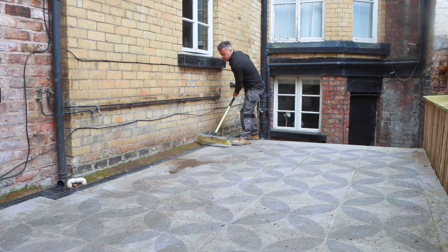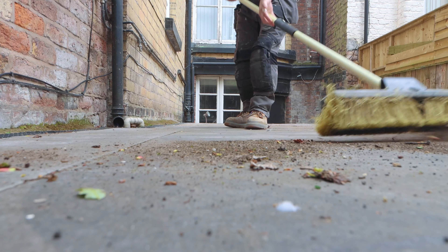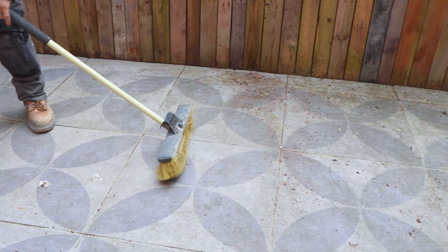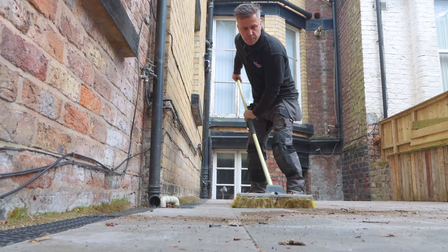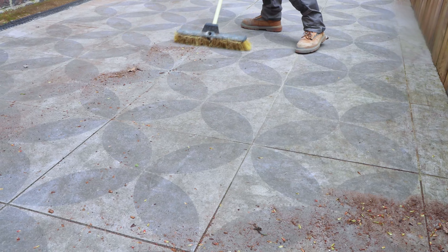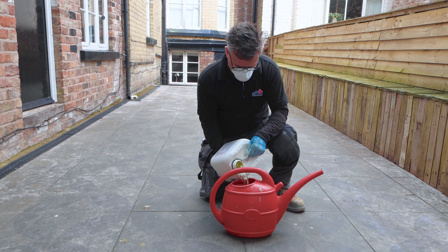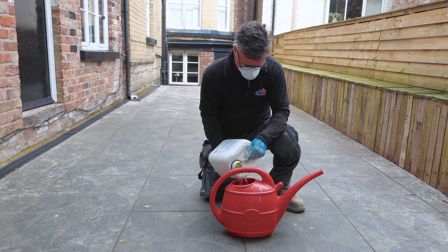So of course a lot of sap and things are falling from them making that end a lot stickier and grimier. Start by clearing off all dust and loose debris from the surface and clear away any furniture so you've got a clean run at the area. This is a five litre tub and will clean around 25 square meters, so I'll be using three tubs for this area. It's applied neat using a plastic watering can — you can even use a light pressure garden sprayer.